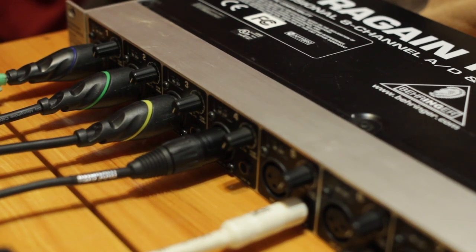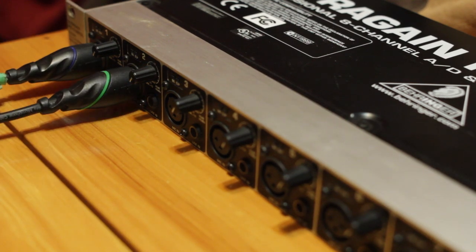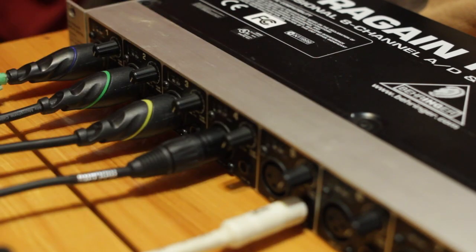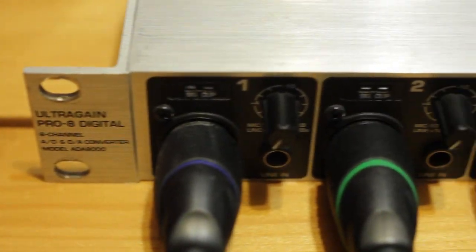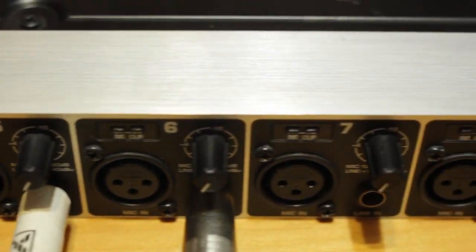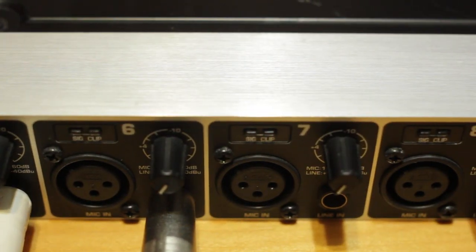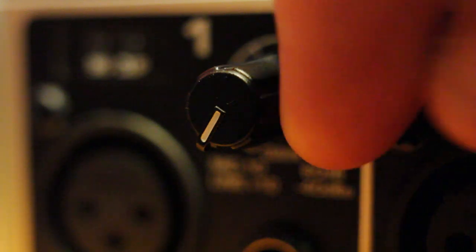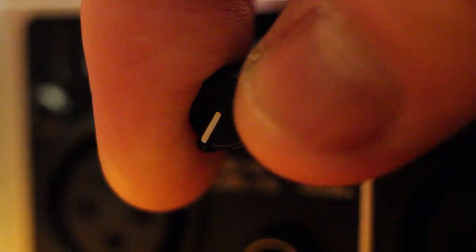For the connections on this unit, we have XLR inputs on the front along with line inputs. The XLR inputs are used for mic level signals. Line inputs should be used with other devices such as extra preamps or a direct box, but they're not for plugging in instrument level signals like a guitar. Each input has a control for the level, and there are detents on the level knob so it can be set to the same place every time. This is good for getting consistent levels, especially between stereo pairs of microphones, but prevents you from fine-tuning the level.